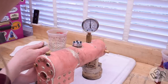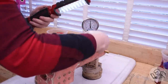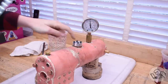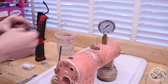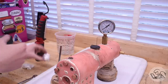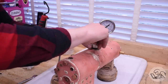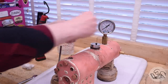Sometimes if you can't tell where a leak is coming from, just go a little higher on the pressure and the leaks will get more obvious. At 150 PSI the steam dome base blanking plug let go - the paper gasket in it is not good enough. Paper gaskets work fine except that they don't reuse very well, and I need something I can use over and over for these tests. I replaced it with a soft rubber gasket from sheet stock, made longer bolts, and bolted it back on. This should give me a much better seal that I can reuse test after test.